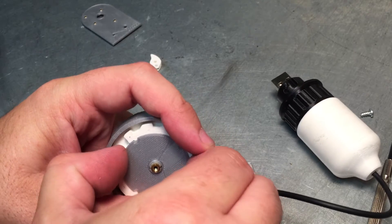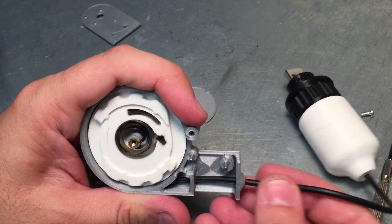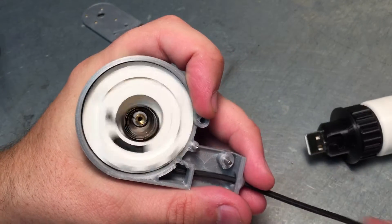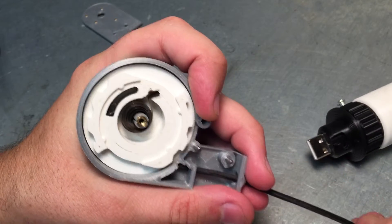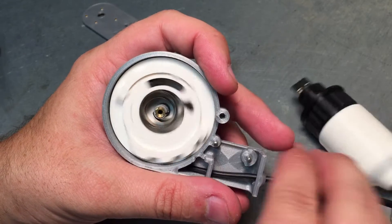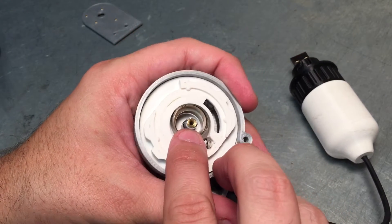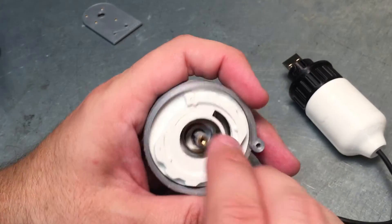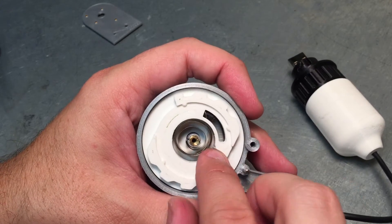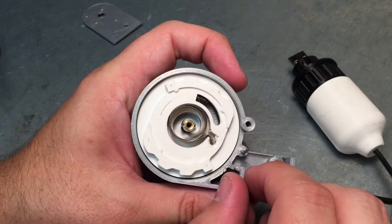Overall I tried to enlarge the size of the cutout. What happens is the spring gets smaller and smaller as you pay out cable, then expands. I've tried to vary the length of this spring and tried a couple of different springs — I'm taking them out of small tape measures. A larger tape measure is unfortunately an even larger piece which simply doesn't fit, or it's thicker and simply doesn't fit.